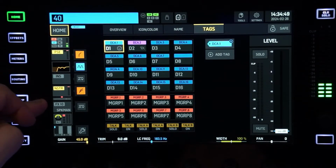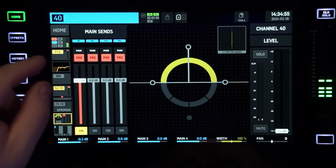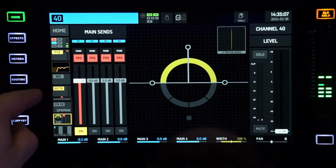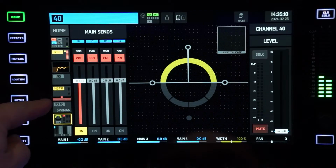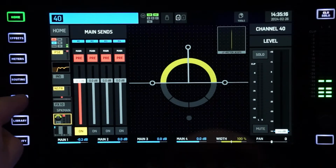Let's do, for fun, DCA 1. Now my fader is in DCA 1, and I heard a click in my headphones, so I'm going to guess that if I'm on DCA 1 and I go mute. Okay. Do you guys see that line here? I'm on my channel 40, and even if it's post-fader or pre-fader, because my physical fader here does not do anything to the volume that you guys hear. If I mute the DCA and I physically touch the DCA and mute it, it's going to mute the channel. Can you see that little line there? It stopped the signal right there.